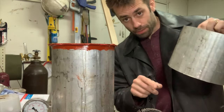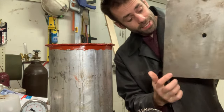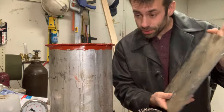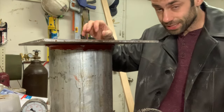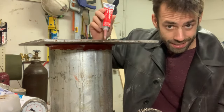We're not done yet. For a flask that isn't perforated, I need a casting table. I took a sheet of plate steel and drilled a hole in it. I'll put some sealer on there, take the steel plate, set it right on top — that should create a seal and I should be able to make a seal on top of the plate. Now I have a casting table.